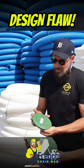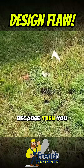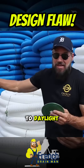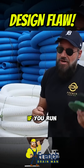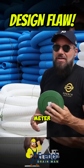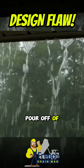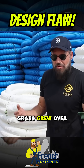Another thing that used to frustrate me — these are really tiny. The grass grows over them in a minute. That's a problem because then you lose them. Now your underground downspout system is not daylighting. What that means is your water has to be taken to daylight — you can't lose your water underground. Nine times out of 10 you're going to a pop-up emitter and it needs daylight. If grass grows over it, all that water is going to pour right at the roof, your gutter trough is going to fill up, and you're going to end up with a flooded basement or crawl space over a pop-up that the grass grew over.